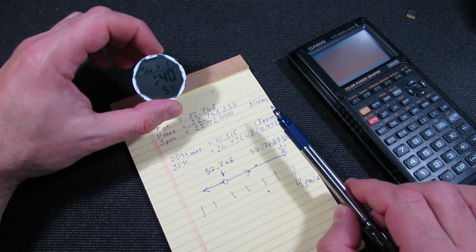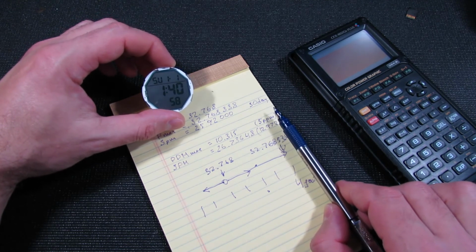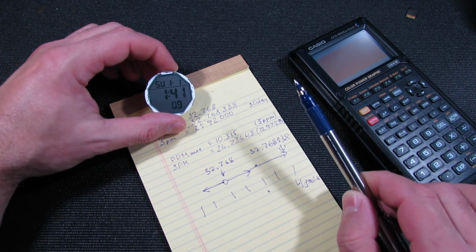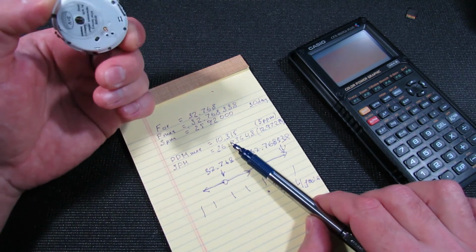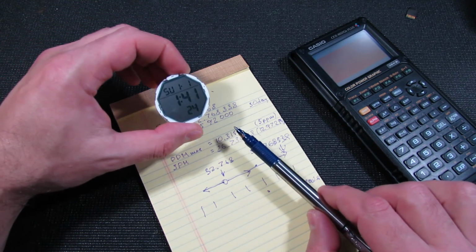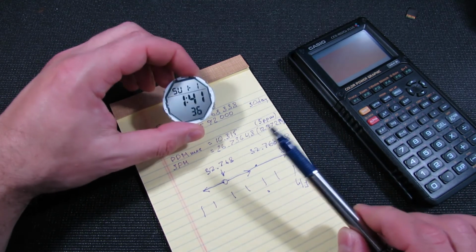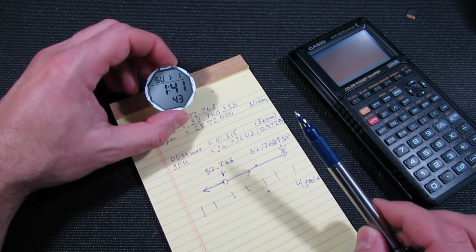On the internet I found the information that the best regular crystal quartz for watches can give you 5 ppm. It means 12.9 seconds per month. So my result is actually not so bad. This is a super cheap crystal quartz watch, and it's not something very accurate. Another moment. It's okay. Every year, a crystal quartz can lose accuracy or drift a little bit from the original frequency.